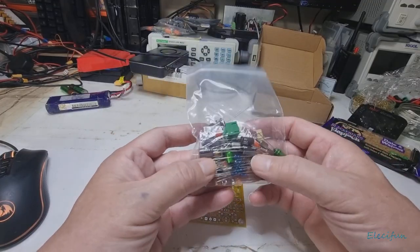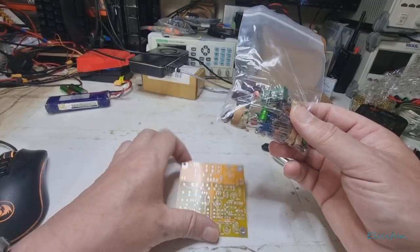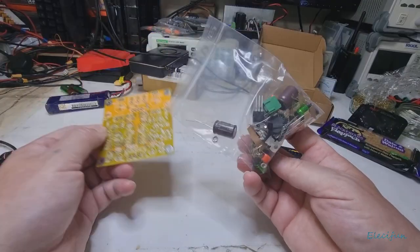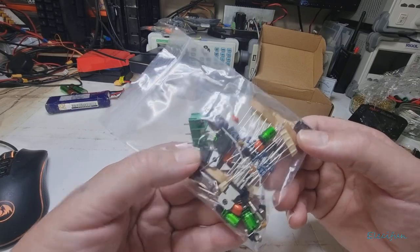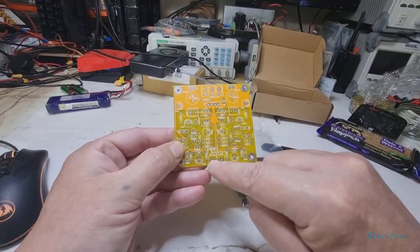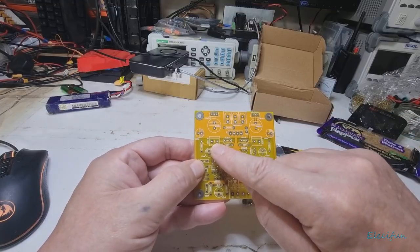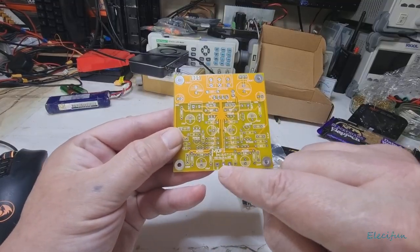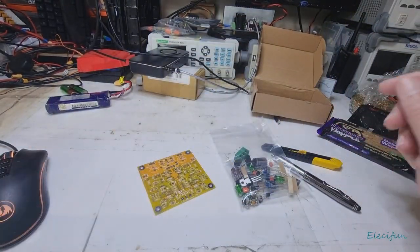This could come in handy for some, but you can see here that's for the AC going in. What you don't get — without me taking it all out you can see that you don't get any connector blocks. So there's nothing for the power line going in, the signal going in, or the signals coming out. That's something to keep in mind — you'll either be hardwiring that or you'll need connector blocks not included in the kit. Maybe that's what keeps the price down.